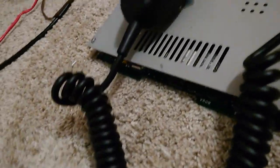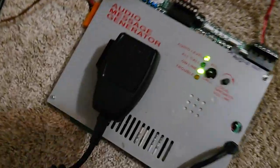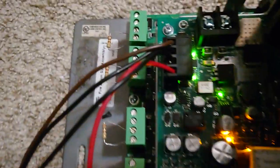And you could get it through if you had this programmed correctly. So now I'm going to demonstrate how to set this up. With the Notifier AMG, you would have this really complicated cable that's meant for the MPS400. But basically, if you look over here, you see there's a 24 volt, a 5 volt, 24 volt, and like 4 system commons. What I did is, you have to use this port.